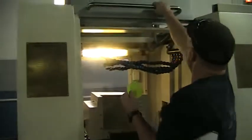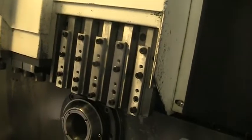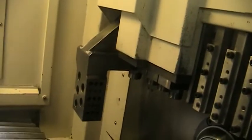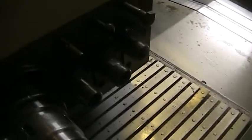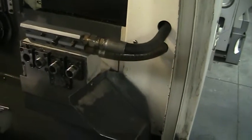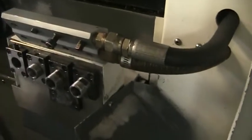Let's open up the doors and show you the inside — we'll show you the inside of the work zone first. There are 5 turning tools, 4 rotary tools, 1 offset for slotting, 5-position end working and back working tool positions, and a 3-position end working. The first 2 positions are live or rotary on the sub-spindle, and a 4-position back working.